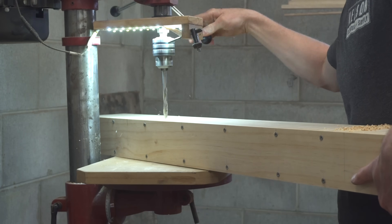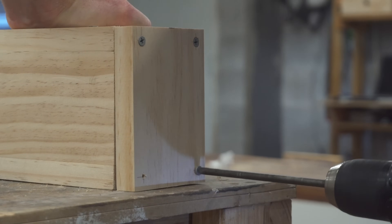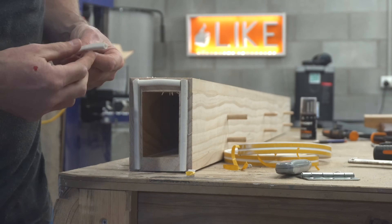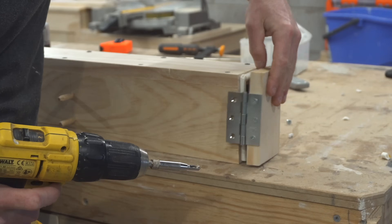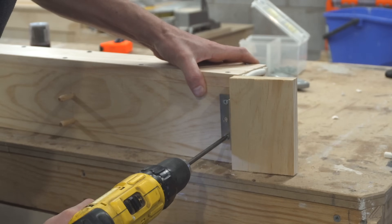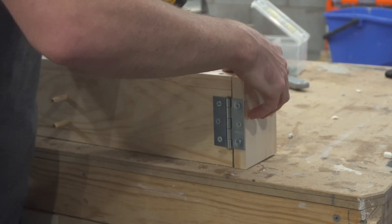With that failure out of the way, it brings us back to building a solid wood box. I screwed the back panel in place and then worked on the front panel, which needed to open and close. I used some cheap window seal as a gasket and attached the front panel using a hinge and a clasp. The idea is to keep the seal as tight as possible for better steam control, though if it leaks a little it's not the end of the world — ultimately you want the steam to flow through the box from one end to the other.